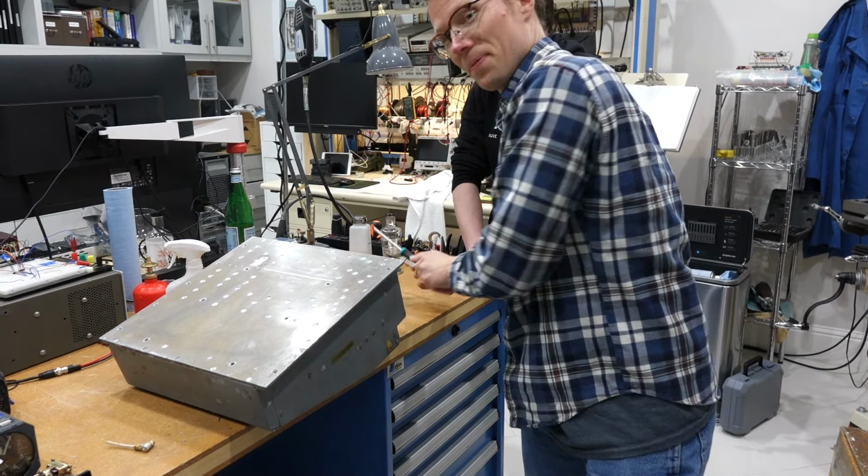The fuel cell power was distributed over thick conductors called buses, main DC bus A and main DC bus B. Normally, fuel cell 1 powers main bus A, fuel cell 3 powers main bus B, and fuel cell 2 is connected to either A, B, or both as a backup. And that's why you hear the famous main B bus undervolt call on Apollo 13.